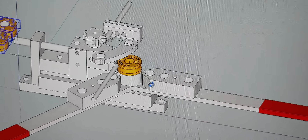I have this machine designed on CAD — I basically took all the measurements. As you can appreciate in the CAD model, I had to bring out all these components for this universal bending machine. It doesn't have the knob; this is actually a threaded rod that allows it to move in and out and clamp the tubing in place. You almost have to do this in order to get the dies properly designed. I'm going to be working on other modifications and adapters for bending round tubes, solid stock, flat sheet, and flat stock.